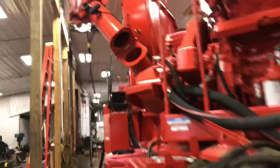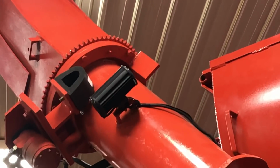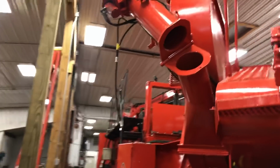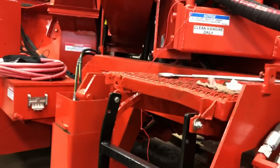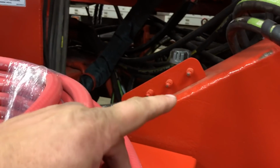Okay, your spout takes grease. I'll show you where. It's spinning together. That takes grease. And then the cylinders take some grease. So work my way up here. I would crawl down. This is the exact same setup that's on the 2755. The only difference is there are hoses running right here that you have to lift up out of the way to get to that last two.